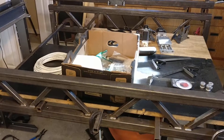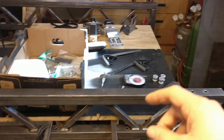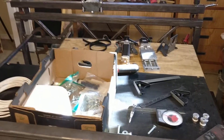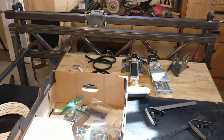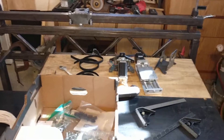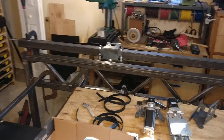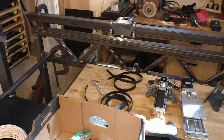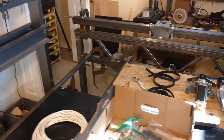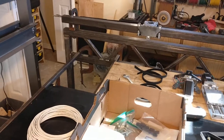The design here leans towards being somewhat modular. There's plenty of welding involved, but there are still a few key connections I'm going to be bolting. The reasons for that are threefold. For one, I already have several upgrades planned for the machine — I have it mocked out with a belt drive on the carriage roller, and eventually there'll be a rack and pinion or possibly a ball screw. Those sorts of changes will be easier to make if I can remove portions of the machine with bolts and then reattach them, as opposed to cutting off and redoing welds.